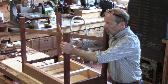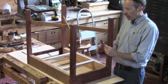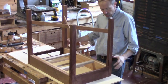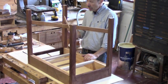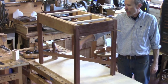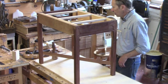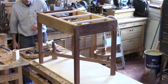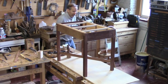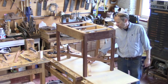What you want to do is get everything together, and since these are flexible, I would check my diagonals and get them the way you want them — there's a possibility things can wiggle around a little bit. Generally, when you have draw pins and drive them in, it's going to be in the right spot. This thing's floating so it may not end up being dead center, but it doesn't matter — you literally can't tell visually. If you can't tell visually and it doesn't affect it structurally, in my mind it doesn't matter. It looks good, it is good.